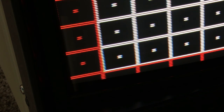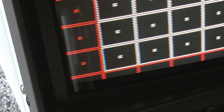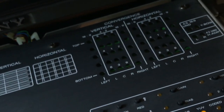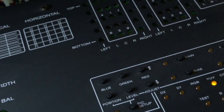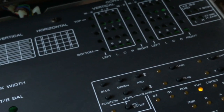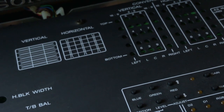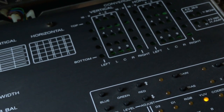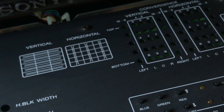And this is the horizontal bottom left pot. If you make an adjustment on the bottom left it tends to adjust something else somewhere else on the screen that you didn't intend. But if I want to, I can go in and turn all these pots right here and get that picture dialed in perfect. You've got the vertical and the horizontal — what is it, three, six, nine, twelve, fifteen pots.